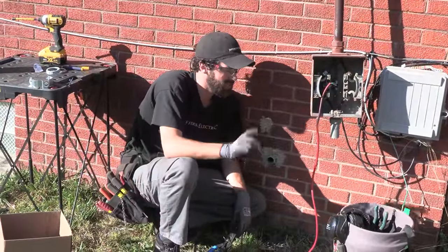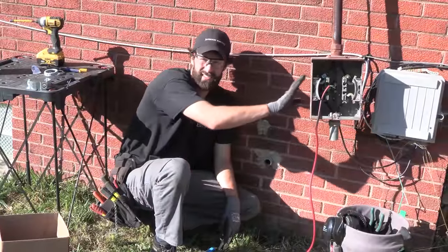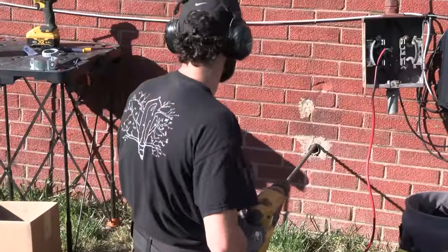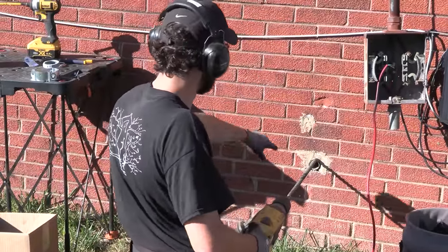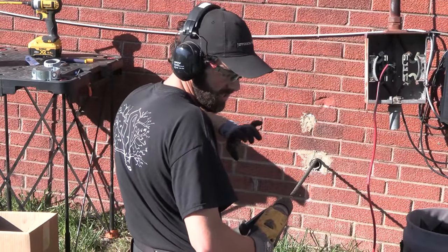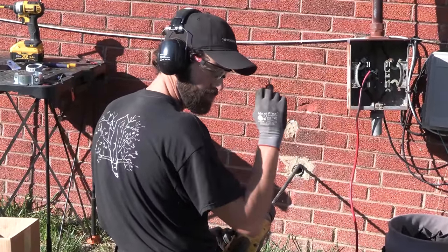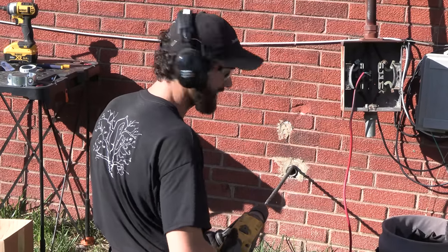But what I wanna do before we take off in 35 minutes is I wanna finish using our power and de-energize this so we're not walking away from a hazard, and do a little tidy up so our tools aren't gone by the time we get back. We're gonna make our penetration into the house. I'm gonna run a series of holes, because like I said, all the core drills were already checked out for other jobs. Series of holes around this to open it up for essentially a 3-inch clear is what I'd like to have. That gives me a little bit of wiggle room on my 2-inch conduit, and then a small enough joint around the perimeter that I can seal it up with my OSI.